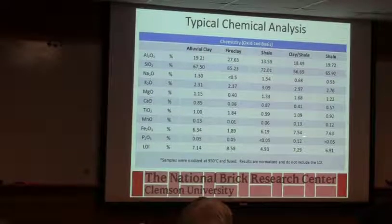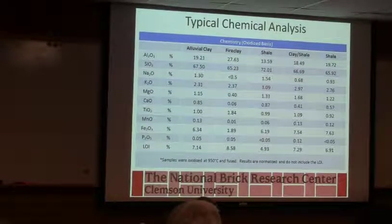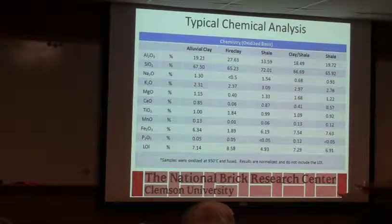Then the iron oxide we talked about helps us with the color of the body, and it could be manganese. But basically, if you looked at the periodic table, that stuff right there around iron is what gives us all our colors. So if you're making a glaze and you want to give it a particular color, you'd figure out which element gave that color, and you could design your glaze that way. Like blue, you use cobalt. Greens, nickel. Sometimes it can be copper. Copper can make a whole bunch of colors. So there are different elements that you would incorporate into the glass to get the color you're interested in. But for our types of materials, most things are iron, manganese, and occasionally you see chrome come into the picture.